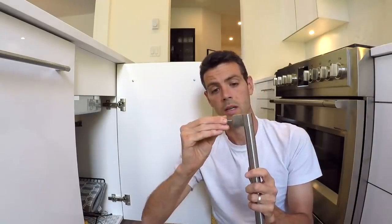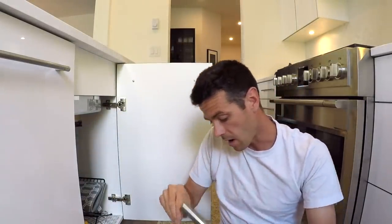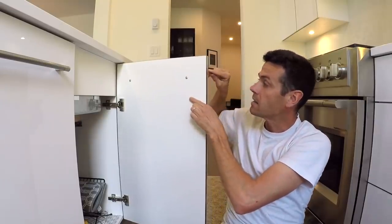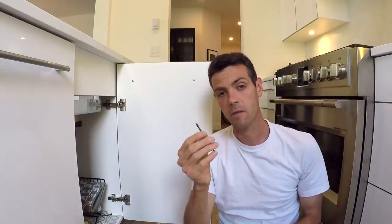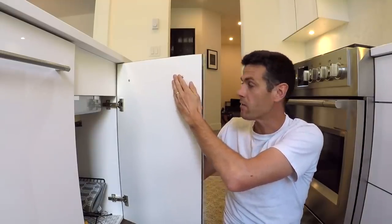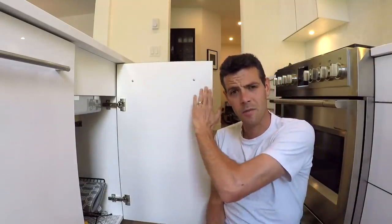The next thing you're going to do is drill a hole through the cabinet so the screw can go through — it sandwiches the drawer front in between the two pieces. Now, you want to make sure you're using a fairly sharp drill bit. One risk is that the back of the melamine — the plastic back part of the cabinet — can blow out as the drill goes through; it'll just kind of explode, and the screw head might not cover the blowout. If you use a sharp bit and go fairly slowly, it will usually stay covered. You can also hold a block — like a chunk of two-by-four — against the back when you drill through. That will stop it from blowing out as much. Just make sure you don't go through into your hand.